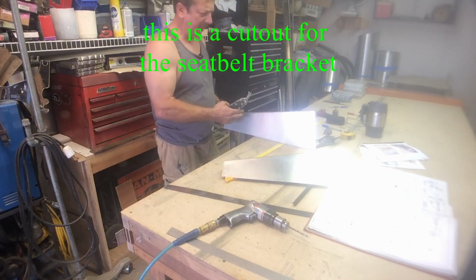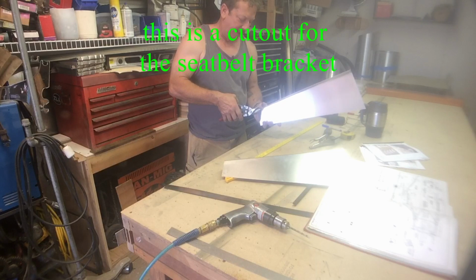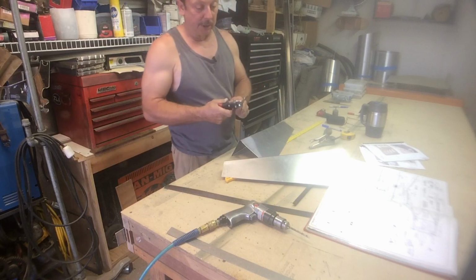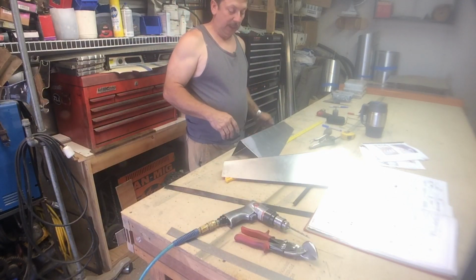Because I don't so much mind spending the time building these, but I'm not going to punch extra holes in the fuselage and then have it not be right. So I'm going to go ahead and get this part of it done, and then I'll mount the flaperons when I get to that point. And after they're in position where they're going to go, and I've tested all that, then I can go ahead and rivet these in place and have them be done.